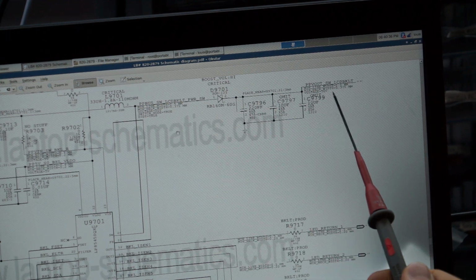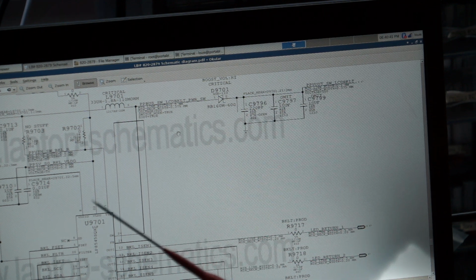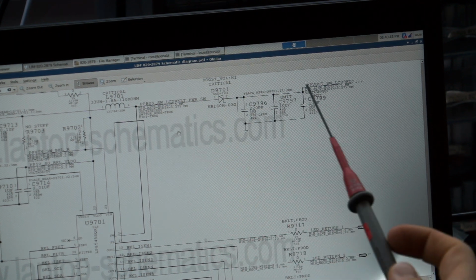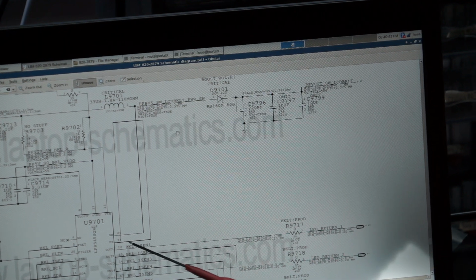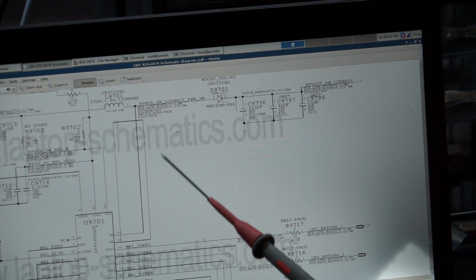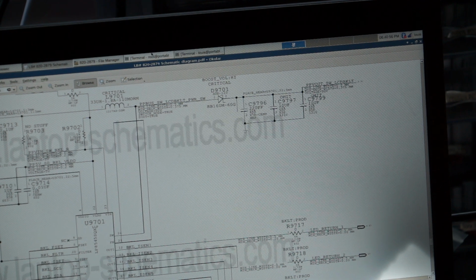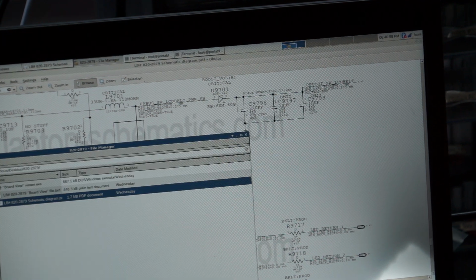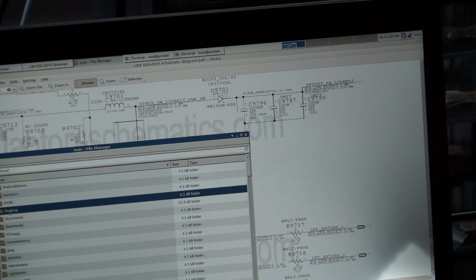Now over here it says voltage 50 volts. So if something messes up in this circuit, the first thing I'm going to check if I think something is burned is where there's the most voltage, directly on output. Most of the time this little trace is burned. Now as you can see on this board, feedback is just going up over here and then back to itself, which again I truly don't understand, because on every other schematic, the feedback trace is tied to output. Let me show you another one.